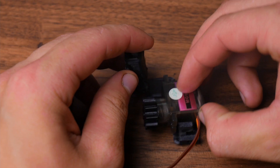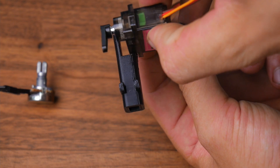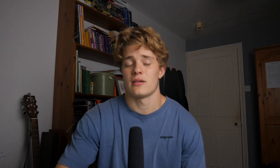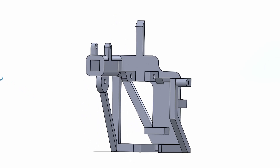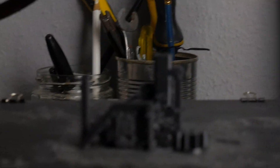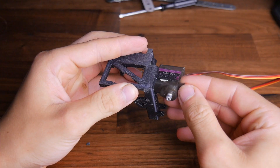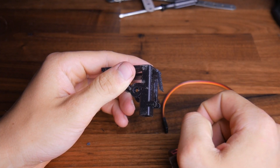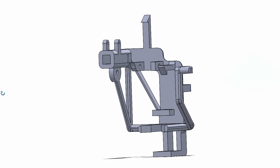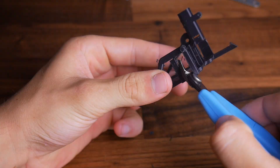Once I had it printed and cleaned up, I could put in the servos, see how they fitted and see how it's going to work. The main issue with the initial design was that some of the servos didn't quite fit, so it was back to CAD where I made some improvements, changed some measurements, and then printed it again. I put everything back in and all in all it was pretty much there, apart from some of the clips keeping the servos in place being way too thin. So all I needed to do was go back in the CAD, beef them up a bit, and print hopefully one last time — and there you have it, that's how I got to the final version.